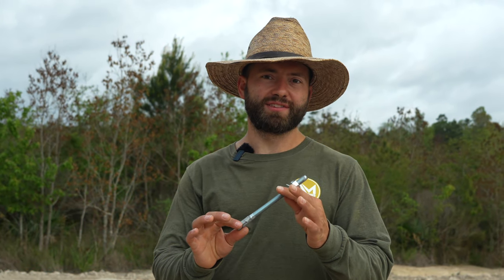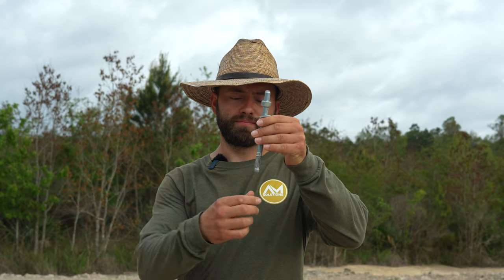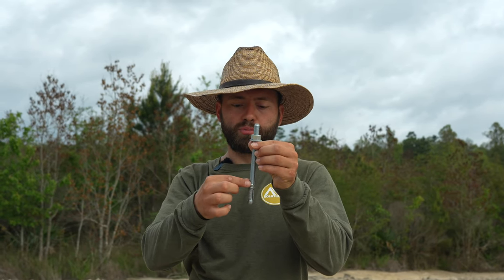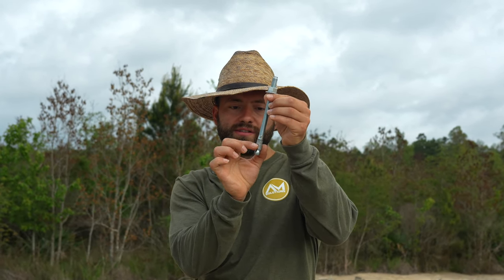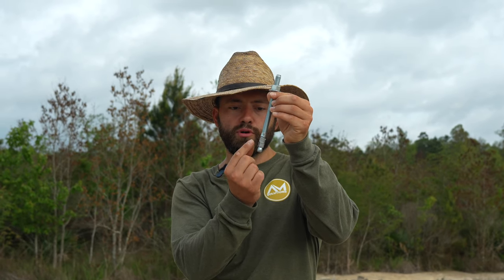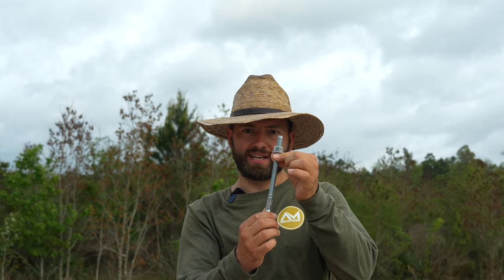So they're anchoring down the base rails with these little concrete anchors. This is a wedge style anchor. So they drill the hole, they hammer this down in there. As this nut goes down, it pulls this bolt up. And this little sleeve right here has ridges on it, so this sleeve stays put in the concrete. And then this nodule right here pushes up into it and expands. And that compression is what holds this together.